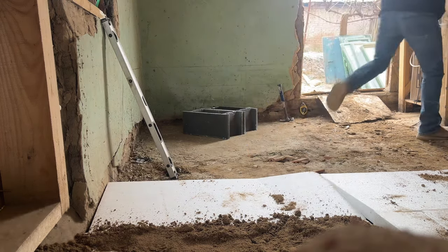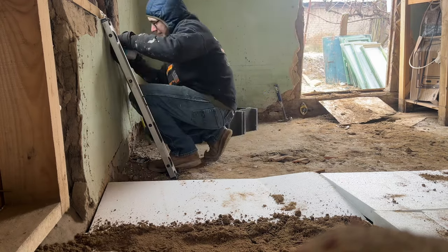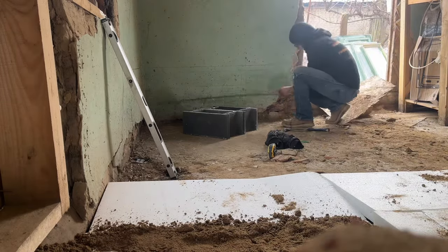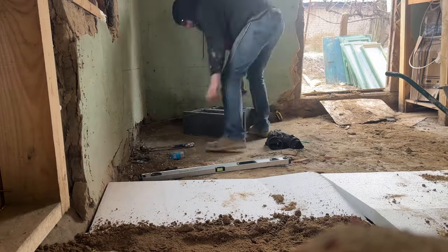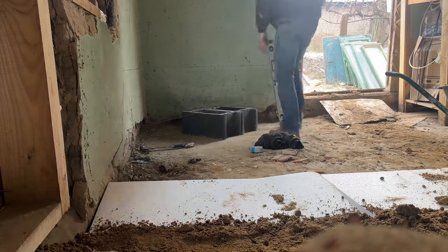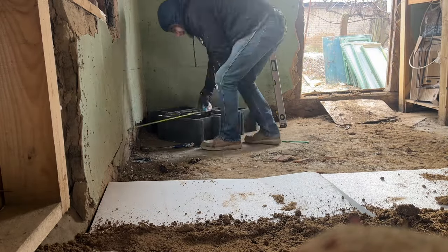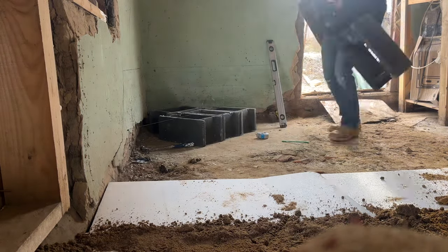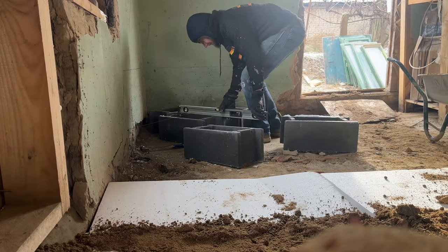The foundation for the fireplace had cured by now, so I got to work setting that up. I just stacked some blocks up like this — I called a friend that does fireplaces and he said I could just use concrete blocks for the base. Then I filled it in with gravel so that it'd be a little more solid. I stacked these concrete blocks up because I'm going to have a hearth in the front and I wanted it a little bit off the ground, but not too far up because the actual height of my floor to wrap beams above is not going to be very high.